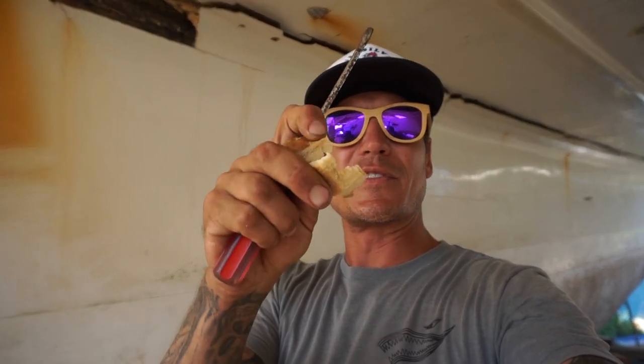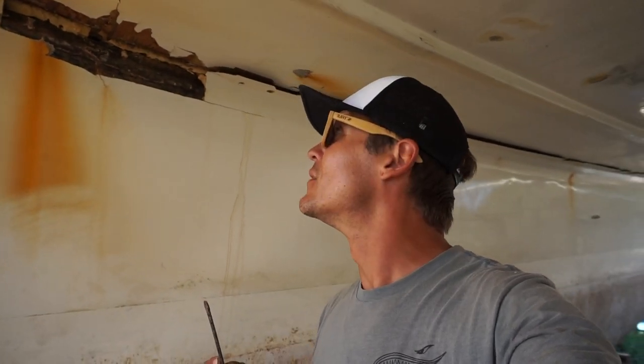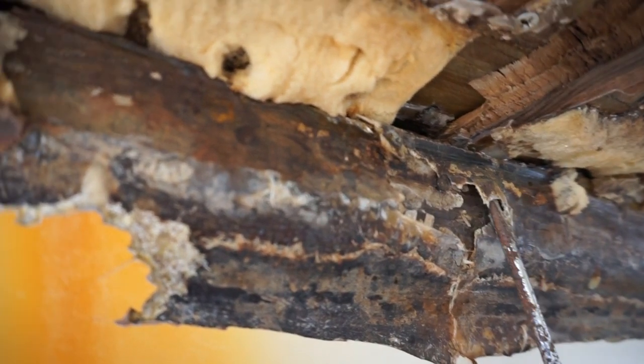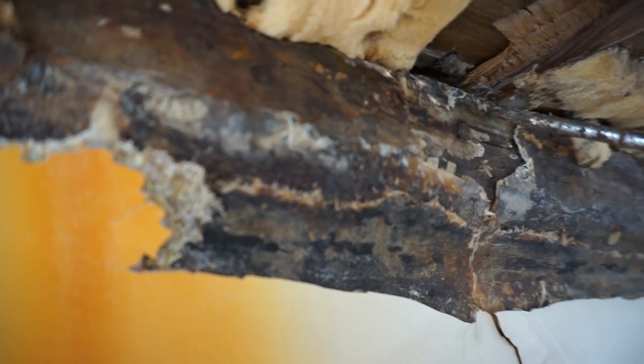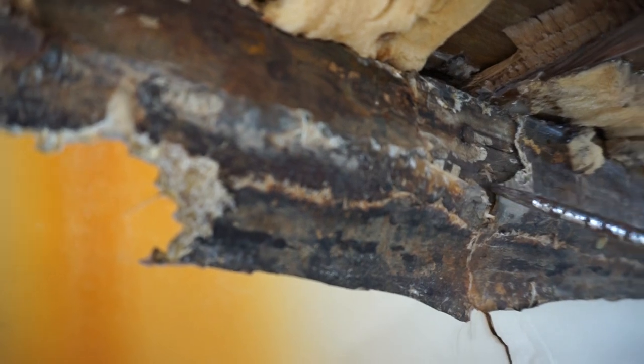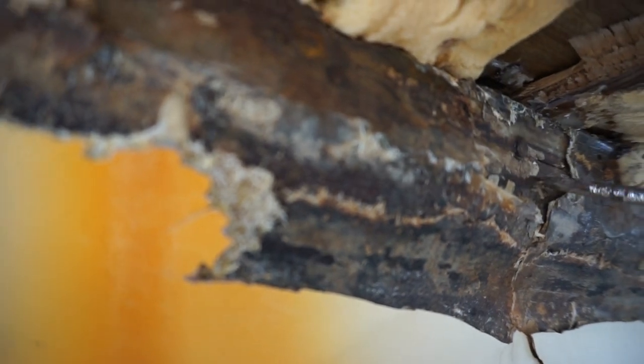It's about four inches and it looks like it's been filled with the spray foam stuff — this is not Airex foam, this is just spray foam. What we're gonna do down here is make sure that this beam doesn't have any rot, because if it does that definitely could have added to the stress. So we're gonna rip off this little layer of fiberglass right here and poke this beam, just see if the wood is hard or if it's rotten. Yeah, that's really hard wood. There is nothing rotten in there. So that's not the problem.